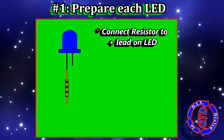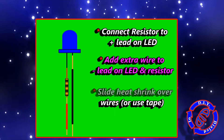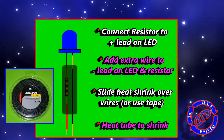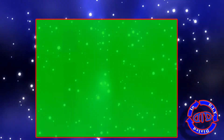For each of the LEDs that I'll be using today, I'm hooking up a resistor directly to the positive lead on the LED. You can either solder or use electrical tape to close off your connections, but I like to go back with heat shrink tube, throw a piece over the end and then hit it with a hairdryer to shrink it down so it keeps everything well protected.